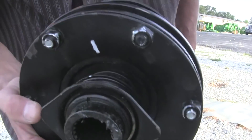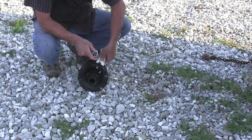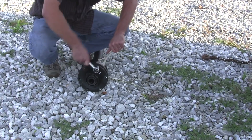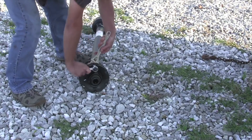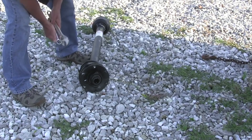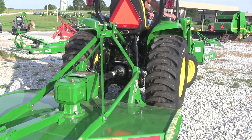The disadvantage of a slip clutch is it has to be adjusted — really every year, and every slip clutch is a little different. Generally, you loosen the bolts holding the clutches together, engage the PTO several times to burn the clutches in, then tighten everything back up. With Jimmy, I suspect he's either got a grade 8 bolt in as his shear bolt with no real protection, or he's got a slip clutch that has never been slipped and properly broken in.